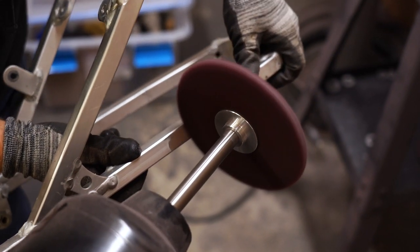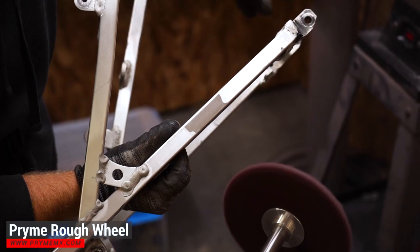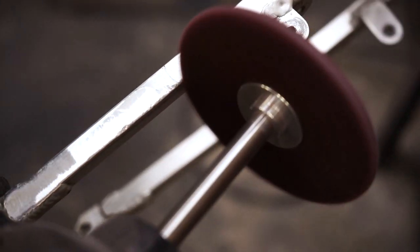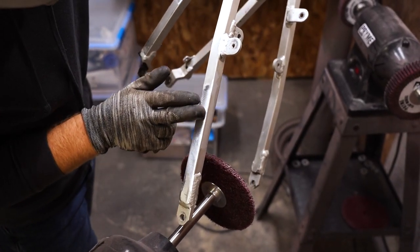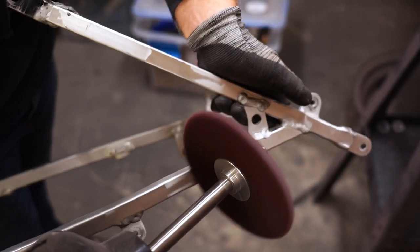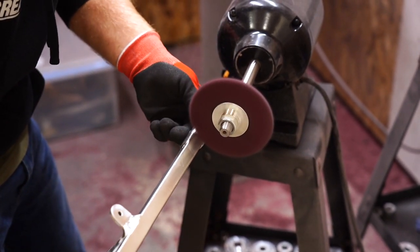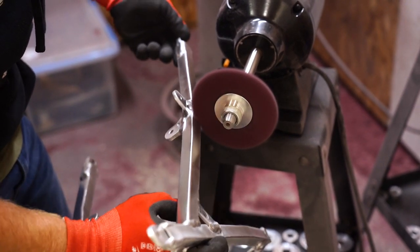The subframe is actually anodized. It doesn't take much to buff through it — just the rough wheel strips it right off. We're going to have to strip all the anodizing off if we want to bring this back to a nice brushed look, and also buff out all these scrapes and scratches. The rough wheel smoothed that out pretty good, but I don't really want to go any further — a lot of the side plate actually covers this up anyway. Now I'm just finishing it off with the finer wheel on the bench grinder to give it a nice brushed look.